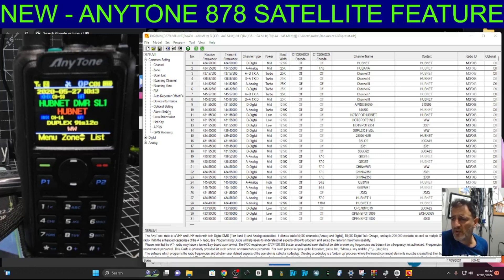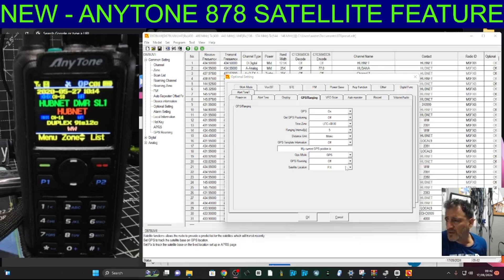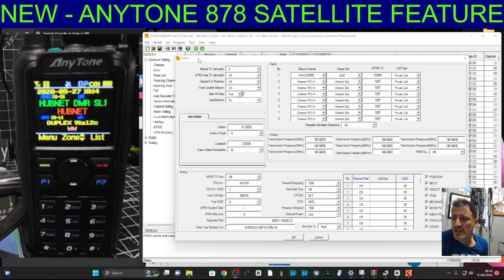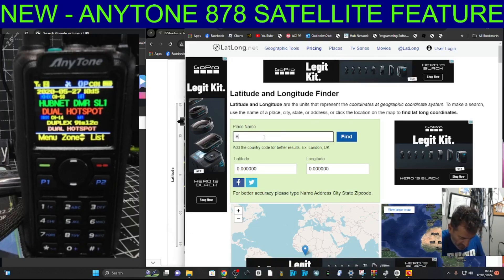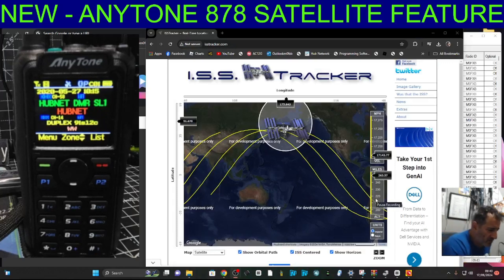The other tip: go to Optional Settings, then across to Satellite Location. You can select 'Fixed' here once you've enabled the GPS option in Tools. Click OK and send that to the radio. Under APRS settings you can set your manual location. I use a site called longitude-latitude - just put in your postcode and it gives you the coordinates. I put in Bristol, UK, and look - there are the latitude and longitude coordinates.